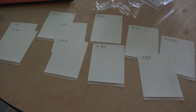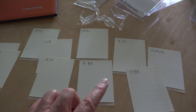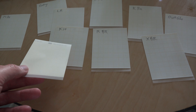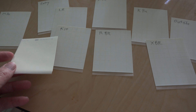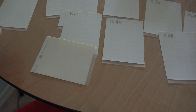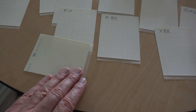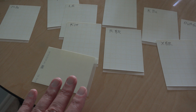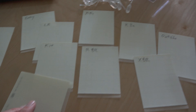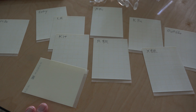Ready for testing: close the windows and doors, turn off the air conditioner and all the fans — basically it's very quiet here right now. These are the backs of my test sheets. I've labeled them, because otherwise you are never going to figure out which one came from where. On the front there's a checkerboard pattern for counting mold colonies later, and a plastic sheet over the surface. I'm going to peel this back, tape it back depending where I put it, leave it exposed for an hour, then close it back up and pick them all up so they're all exposed about the same amount of time for a good comparison of which room has more mold.